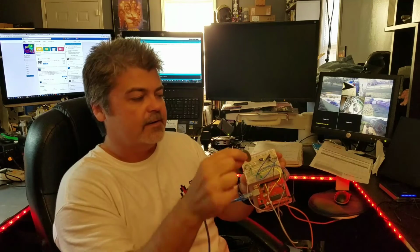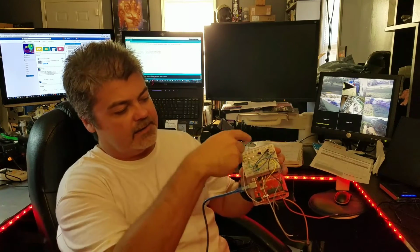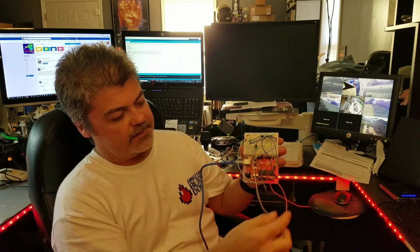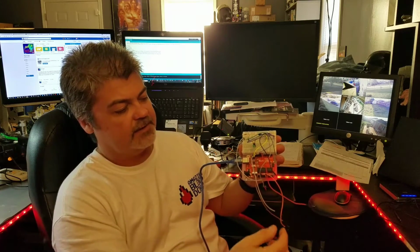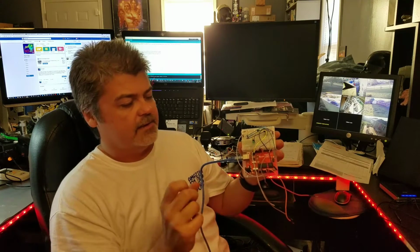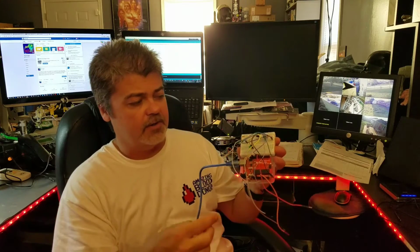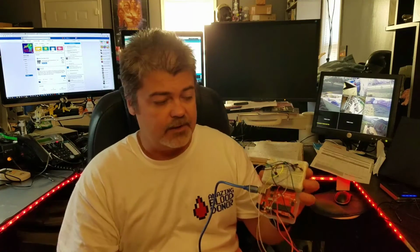So in our case, we're using a quarter. When it slides down through that area, it then triggers a switch, like pin 7, I believe it is, to turn on for about 500 milliseconds, I think, which is going to actually take the coin slot or coin button entry in MAME or MAME for all, and work like a coin door.